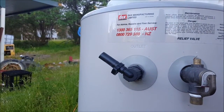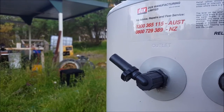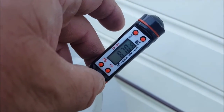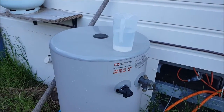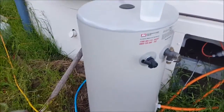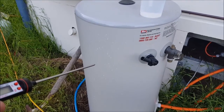It's Friday, 4th of November 2016. The weather here at the shack, while I've been away, has been absolutely glorious — perfect for solar. I've got the master switch turned off. I've just taken a sample of water: 30.6 degrees Celsius, 87 degrees Fahrenheit. That's not really anything special, but this has been turned off since Sunday. The water got hot over the course of Saturday and Sunday, and it's still five days later at 30 degrees Celsius.